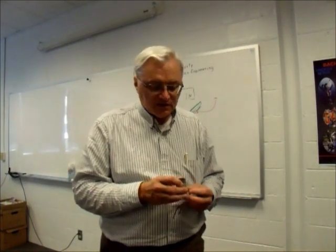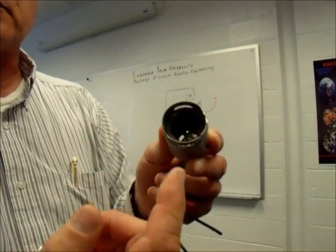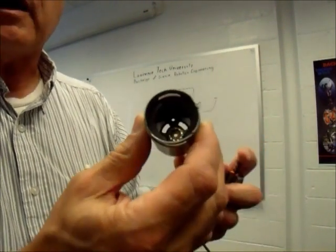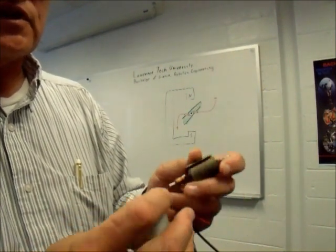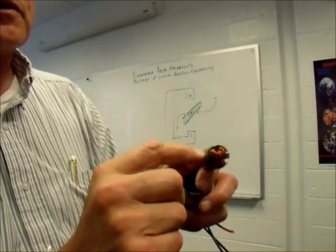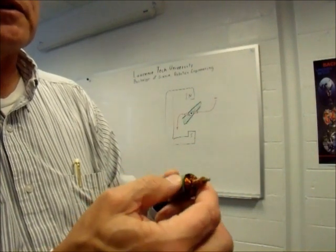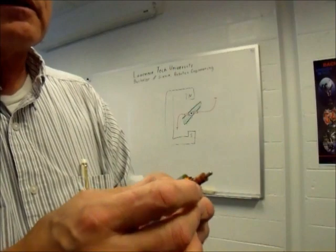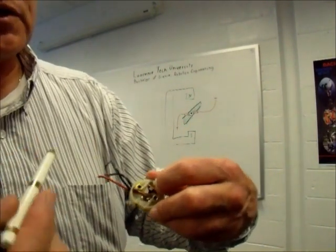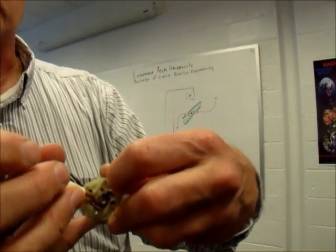Let's start with the components of the DC motor. This is the housing for the motor. Inside we have permanent magnets that create a magnetic field permanently. Another piece is the armature, which fits inside this permanent magnet. The armature is essentially a rotating electromagnet — it has iron cores and windings around each segment of the core. These windings are connected to a segmented copper piece called a commutator, and power gets to the commutator through these brushes. You can see those two brushes here and here will rub on the commutator.